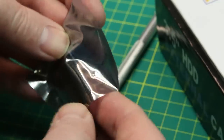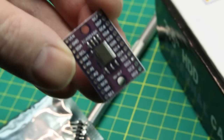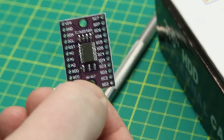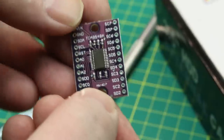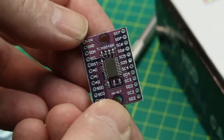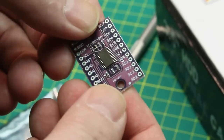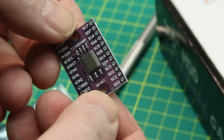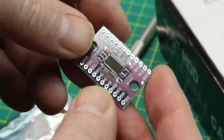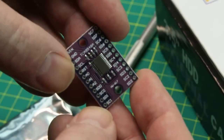These — I don't remember who put me onto these, I had never even heard of them. This is an I2C expander board. This allows you to use multiple devices with the same address on the bus; this will do the splitting between them. Very neat. I think that's where I saw it used — multiple OLEDs. Very neat idea. If you have multiple devices with the same address, you can just plug them in here.